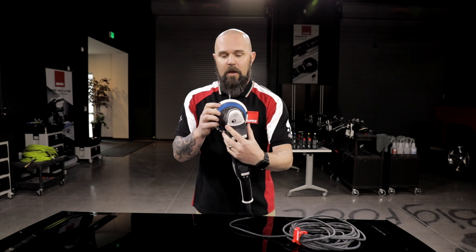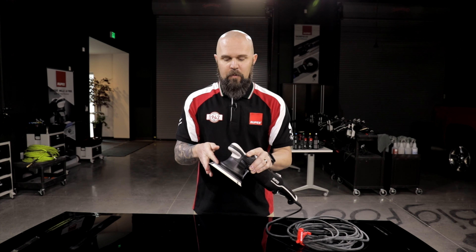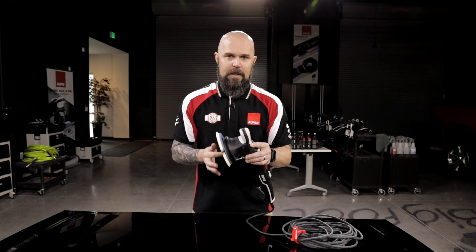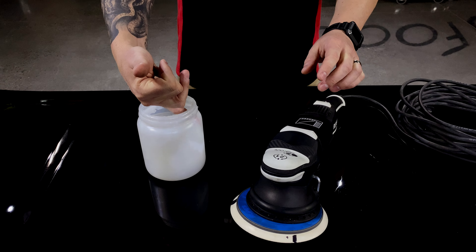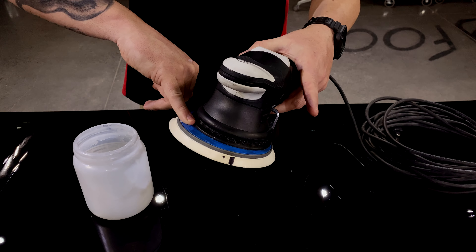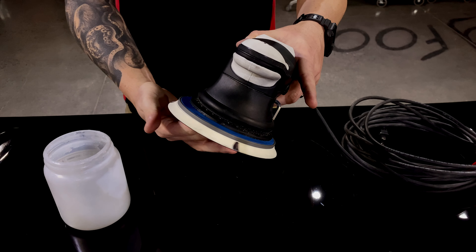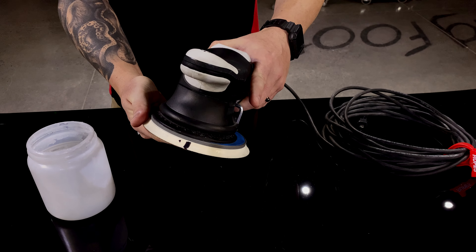The other key is right here on the backing plate. From the factory, there's a small amount of dielectric lubricant between the backing plate and this rubber shroud — it provides a little bit of slip so this moves freely. We recommend about once a month, or more often in a high production shop, take one small drop of dielectric lubricant and put it on the backing plate on the blue part here, then just twist it around. It'll pull that lubricant underneath the shroud and keep that running right. Also, while you're at it, check and make sure your center bolt is nice and tight — you don't want that coming loose in the middle of a job.